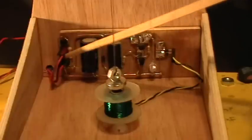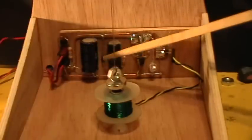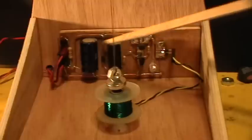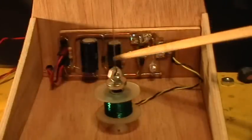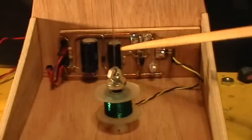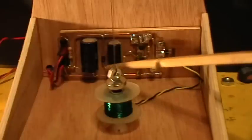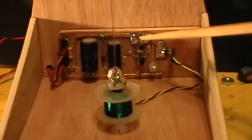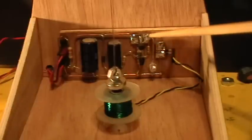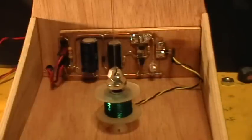I've cleaned up the circuit board a little bit and made one change. I changed the 1N4148 or 914 diode for a Schottky diode — I put a 1N5817 20-volt Schottky in there. I also took out the transistor sockets and just went ahead and put in some solder pads for the two transistors and some connectors, and just cleaned it up a little bit.